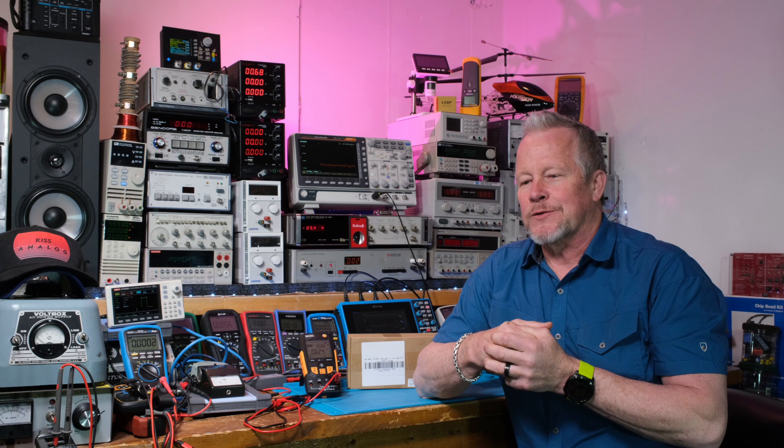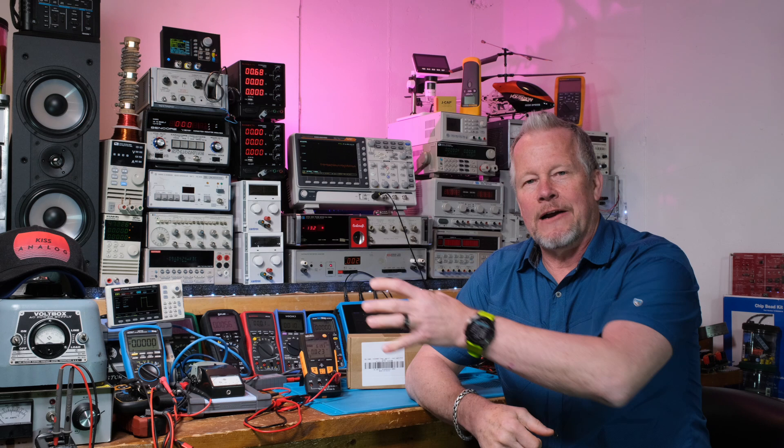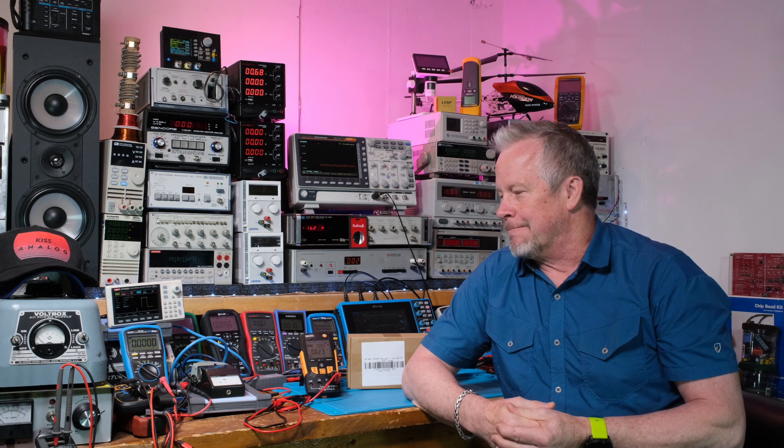Let me know. I'm thinking because we're up around 500 VA — if that's what we're trying to do, 500 watts — then for me I think PFC is beginning to become something that might be useful, might be important. If you want to do higher-power amplifiers in the future, we could always add it later on a higher-power amp. Maybe this power amp. We probably don't need a full 500 watts — I think John was throwing it out there to give some margin, but we're going to have plenty of margin.